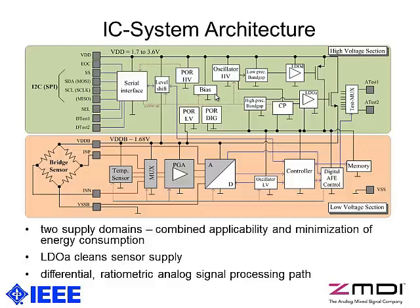In the analog path, where we connect our bridge-type resistive sensor element, we have fully differential processing, and the whole thing is set up as a ratiometric system, meaning all reference voltages are directly proportional to the supply voltage, which reduces distortion. The sensor chip also has an on-chip temperature sensor for compensation purposes, and comprises an on-chip calculation state machine performing digital signal correction based on calibration coefficients stored in an on-chip NVM.